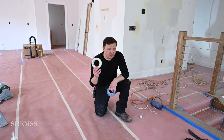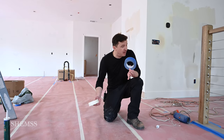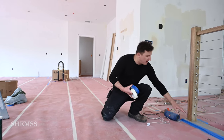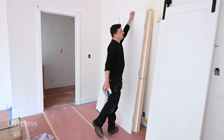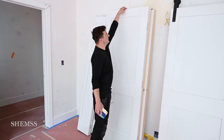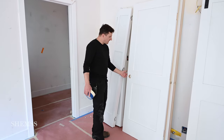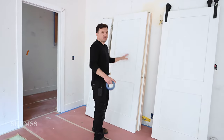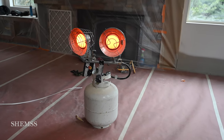You can use scotch tape or blue tape. Blue tape costs more money — everybody knows that. We use blue tape where we are connecting to the wood. All doors are already marked with numbers. I like to mark numbers on the top; some people use the hinges or the doorknob. All doors we put in an open space and we spray two coats.